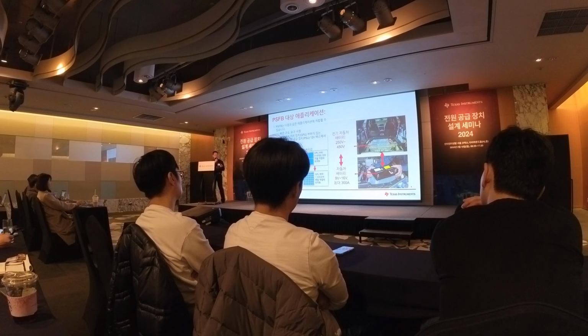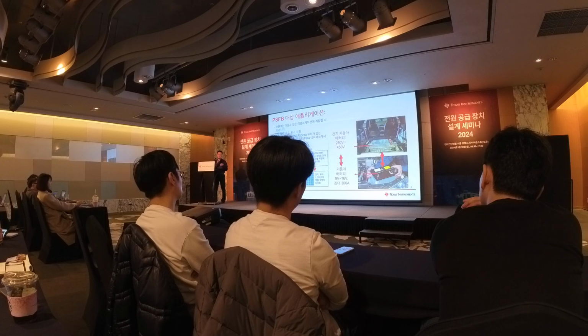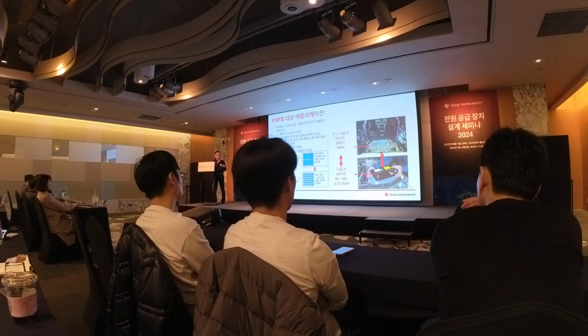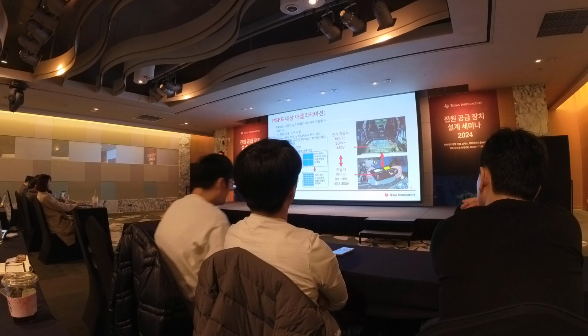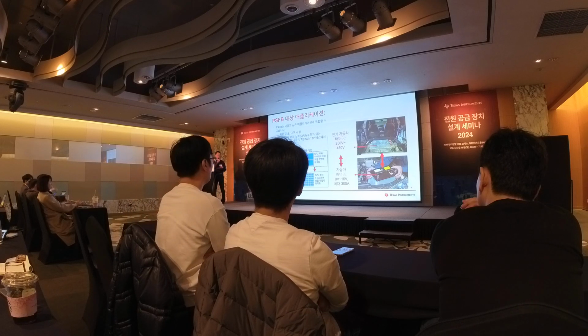If you want to use an LLC resonant converter in this application, then to cover this input and output voltage range, you will need to design your transformer to resonant inductance ratio to be very low, which will result in a high circulating current and low efficiency. But a phase shift full bridge converter uses a different mechanism for soft switching, so you don't have that low efficiency issue in this kind of wide input-output application.